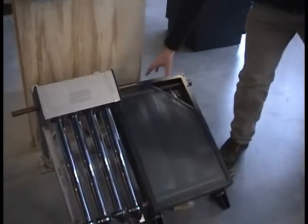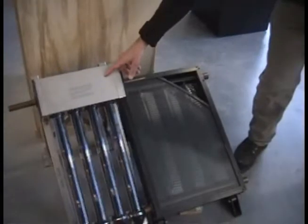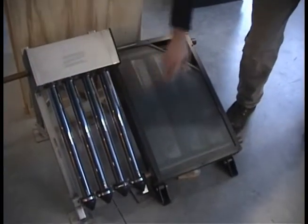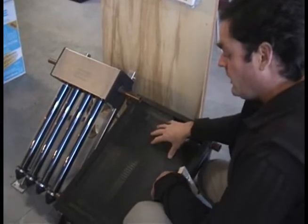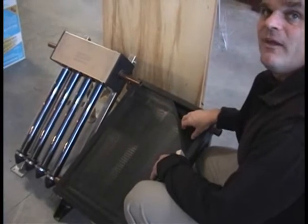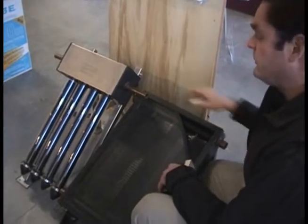The flat plate collector is not as energy efficient or as well insulated as the evacuated tube collector. These vacuum tubes are very well insulated, and when they collect the thermal energy from the sun they immediately transfer it using a heat transfer fluid right through that copper pipe and into a storage tank in somebody's utility room. The flat plate collector will absorb the sun's energy but will also lose it on top of the roof during the winter months and not effectively transfer it to the storage tank.